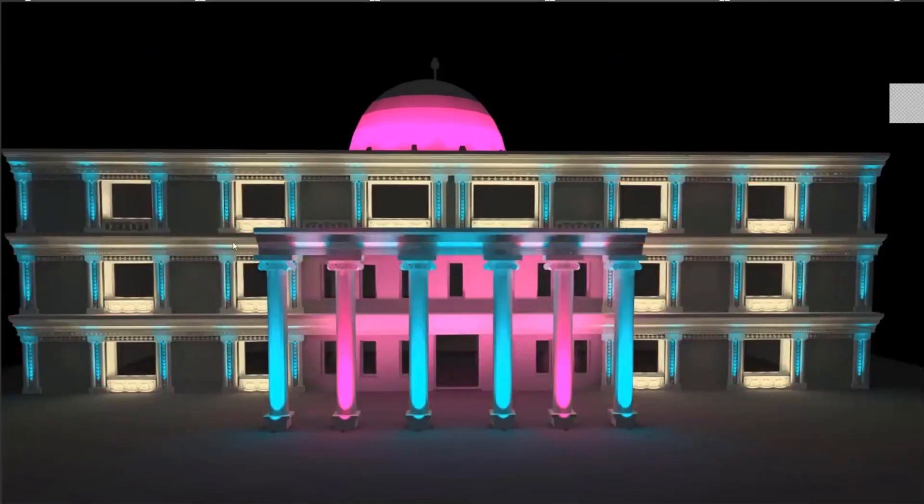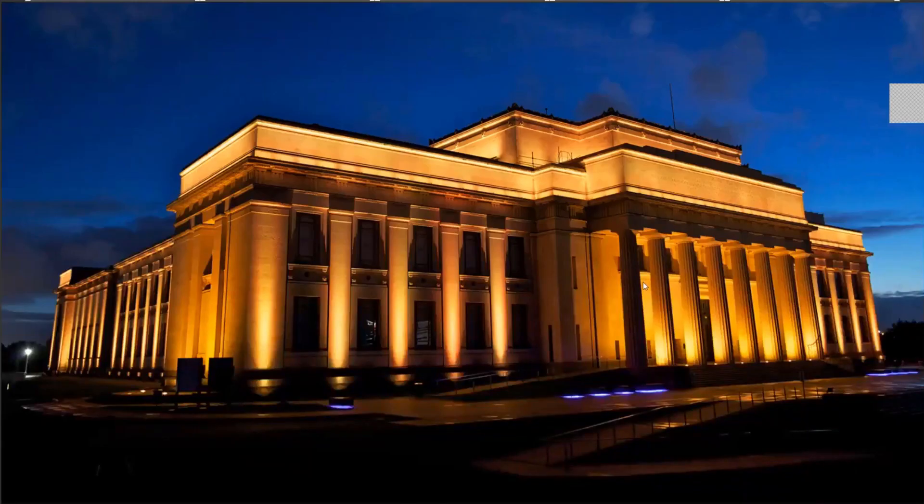In this variant, I've removed the grazers for the solid portion and only highlighted the ledges and pillars — the possibilities are endless, you just need to apply creativity based on the client's requirement. A very good real-time example of focal lighting technique is the Auckland Museum in New Zealand, which has been completely done using Martin fixtures. All of these pillars are individually highlighted, in-grounds are used within the window ledges, and a nice crown lighting has been created using exterior grazers.